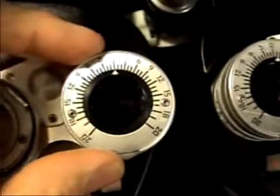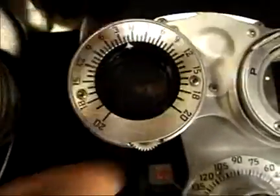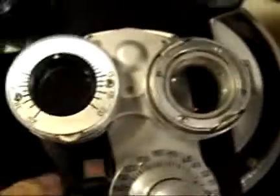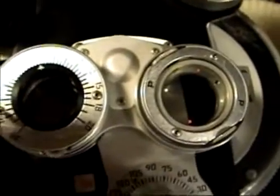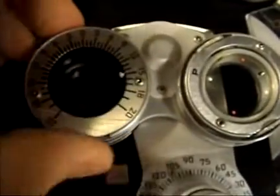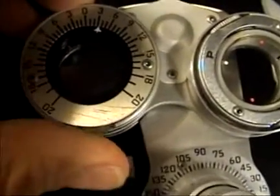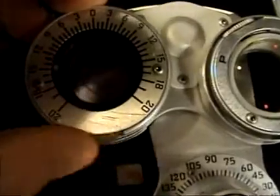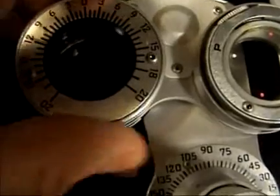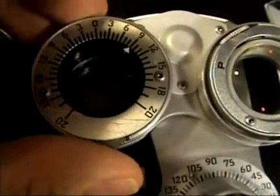With the Risleys back together again, this one moves very smoothly but this one does not. There's a certain amount of play in the plate position — if it's not aligned just right it can actually impinge on the gear and make it hard to turn. You have to play around with the alignment of this plate to make sure you've got smooth movement of the gear once the screws are tightened.